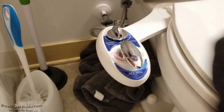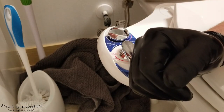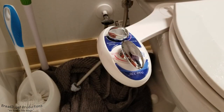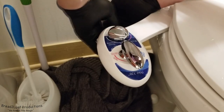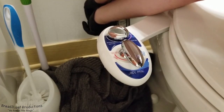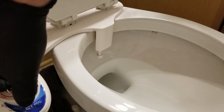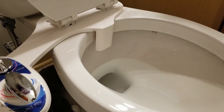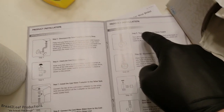And we're going to give it a quick test. Well, that's not tight. Okay, as you can hear the water is back on and we definitely have a leak. I'm going to use a bit of Teflon tape on this connection to the cold water. Take three. Here we go — the moment of truth. Oh boy, that works quite well. My wall is now soaked. So the cold water side: done.